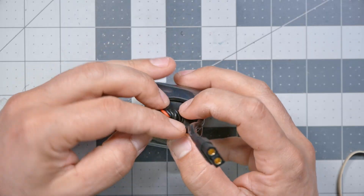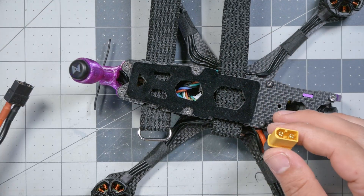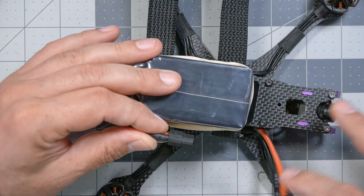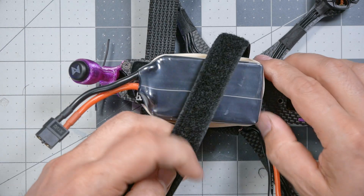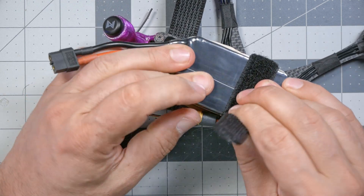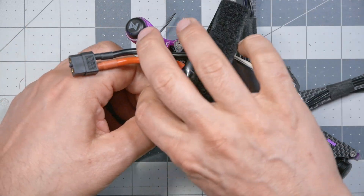I'm going to give that a little twist to take the slack out and tuck it in there really nicely. Next, we're going to solve the problem with the XT60 lead getting chopped. Depending on how you've built your quadcopter and where the XT60 lead comes from, you're going to need to use a little creativity — on some quads it'll come out the front, on some the rear, and the length will vary. Your goal is to find a way to take the tension out of it and retain it so it can't get chopped up. On this build, what I would do is pass this battery strap through like so, begin to cinch it up, and then just tuck this in underneath there — now it is restrained.